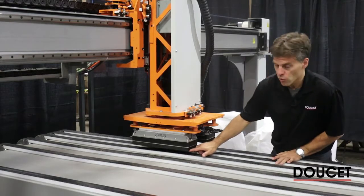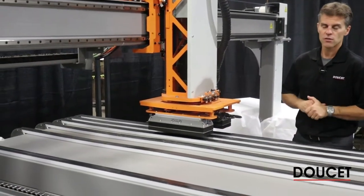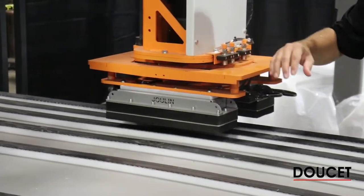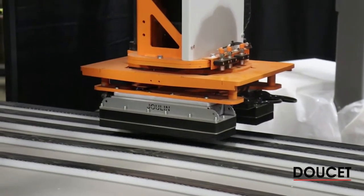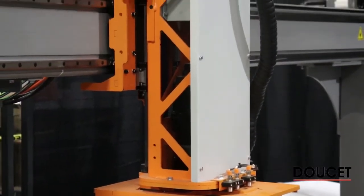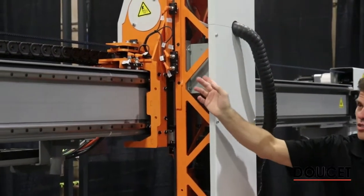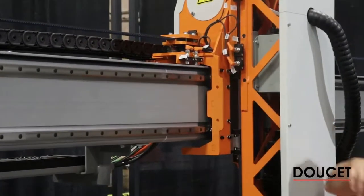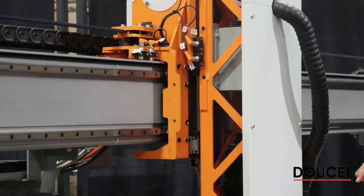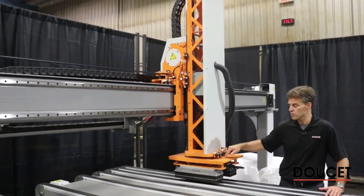We have the vacuum gripping head with our Joulin head — they can grip any type of part in any size. The system self-locates based on the piece sizes, centering as much as possible. Each axis comes with a servo motor. You can see the horizontal way going with the timing belt to maintain our position at all times. The horizontal and rotation axes use a direct drive inside the head.